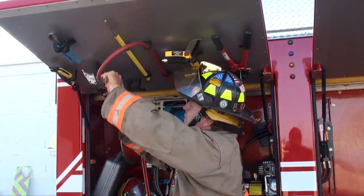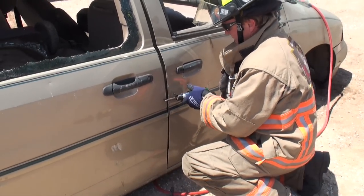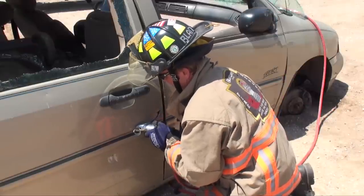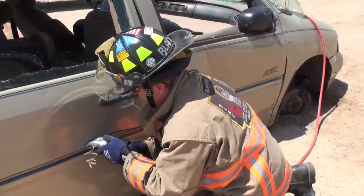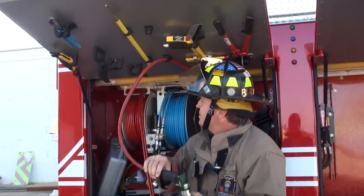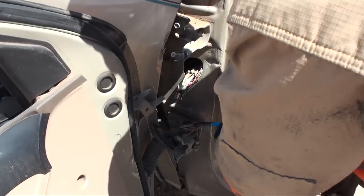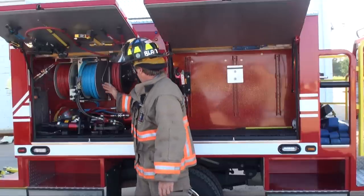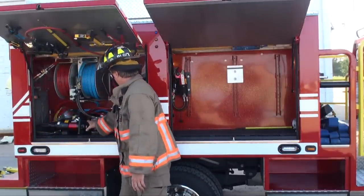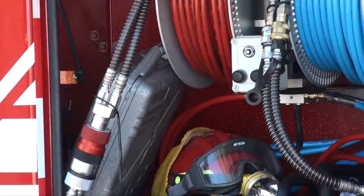Here's a tool we're not familiar with, because it takes so much air — the shear. It's a little air shear. Instead of making noise with the chisel, I take the shear and I can just take the sheet metal and open it up rapidly. This thing will rapidly open up the side of a door so you can reach in and undo your latches. Here's my cutter for my battery. On my rescue side, here's my rescue tools, my hydraulics — I've got a cutter, spreader, ram.